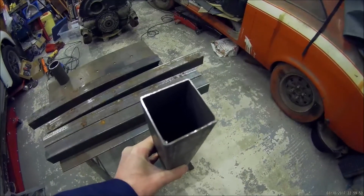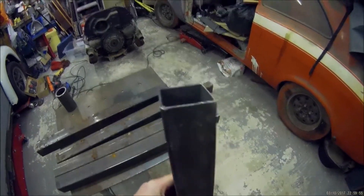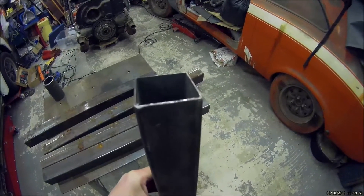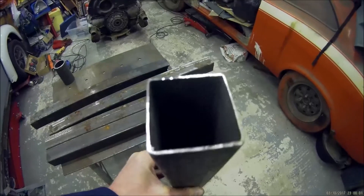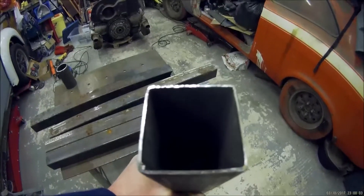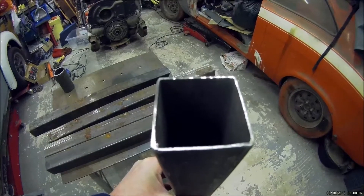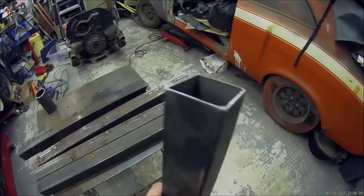Because of the coronavirus lockdown I can't go out and get any new material, so it's a matter of using what I've got. This is two by two box section but it's only thin wall — 1.5mm wall. Ideally you'd probably want three mil or an eighth of an inch, so I'll just have to see how we go and might have to beef it up a bit more.